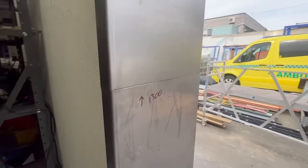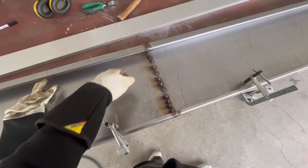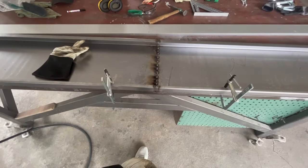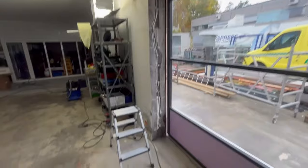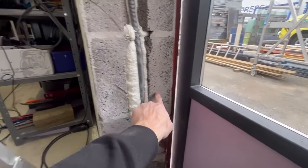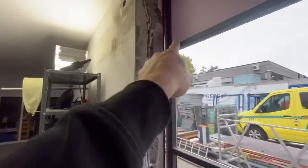I'm going to take it down and weld those pieces together. I'm going to weld only like points - not do it completely over - because of all the heat it's going to be bended and I get problems with that. I think it's better to leave it like this. This plate is now going to be bolted in with two bolts, and I'm taking the measurement straight from this one so it's the same height on both sides.